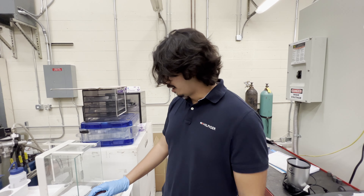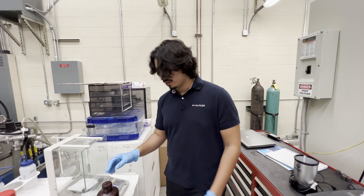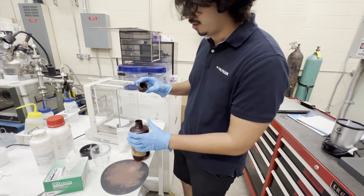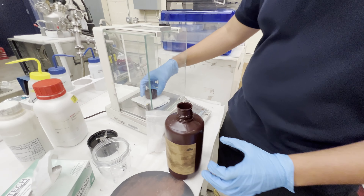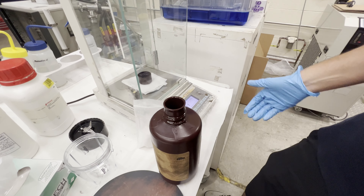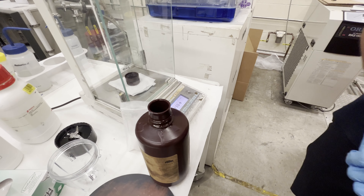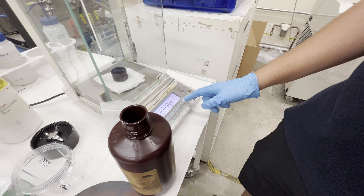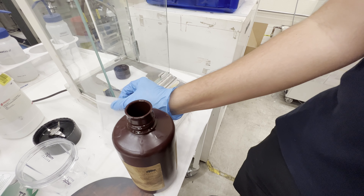This is the most controllable way I've found to measure the resin. First, instead of weighing paper, you want to put a wipe on the scale, and you're going to use the actual cap of the resin bottle as your measuring container. It's essentially the same as with the powder — put the cap on the scale with the napkin underneath in case anything comes out from the sides. You don't want it to spill onto the scale. Once it gets to a static value, this cap is really lightweight, so it's a good container for this.